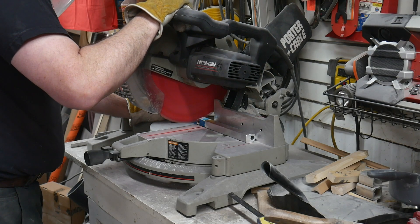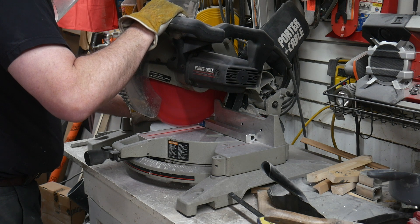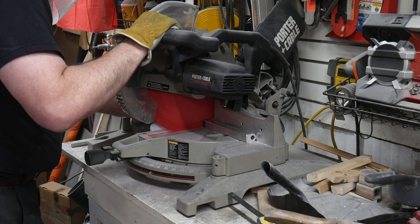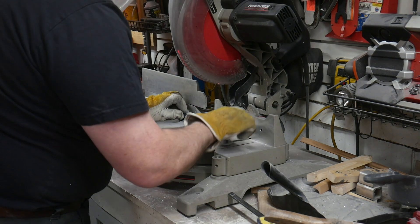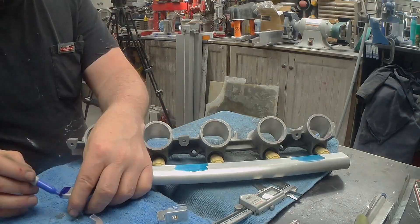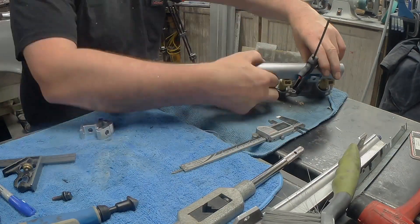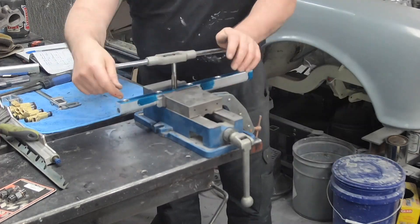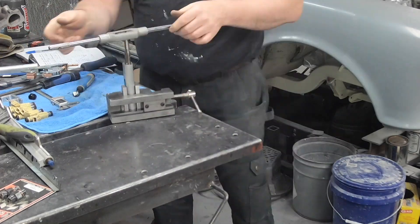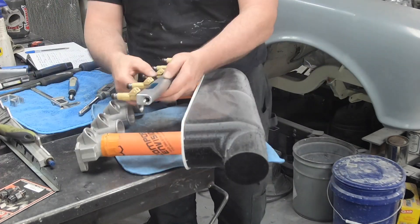With that done, you cut it — don't cut it before. I always leave it long and cut everything at the end. I'm using my 12-inch chop saw with a non-ferrous metal cutting blade. Some people don't know you can cut aluminum with woodworking tools, but there's lots of wood that's harder than aluminum. Now we're down to the brackets — you can see on the mount that goes onto the head there are some bosses I'm trying to pick up. Getting everything else drilled and tapped. These are all ANs — 9/16ths fine thread, something like that. Anyway, if you're doing it, you'll figure it out.